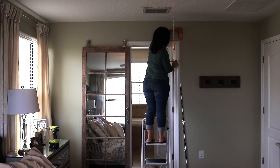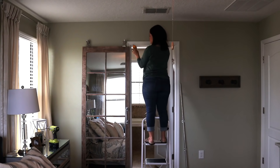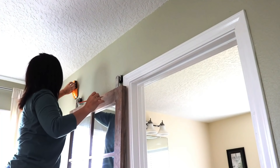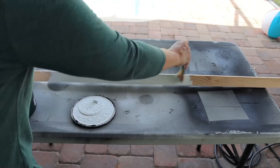In order for our door to be very sturdy, we definitely need it to be hung into some studs. Here's the deal — I really wanted to avoid putting a wood strip across my door, but when I lined up where all the holes need to go, it wasn't going to hit a single stud. In order for it to be sturdy, we need to get it into some studs. The solution is taking a wood strip, installing it above the door jamb — hopefully it doesn't lift it up too much. We're going to go outside, cut it to the length we want, and then paint it in the matching trim color.